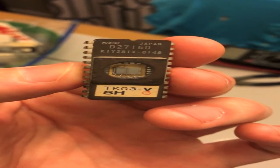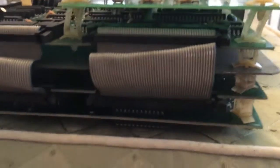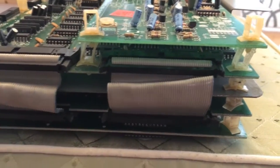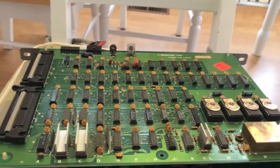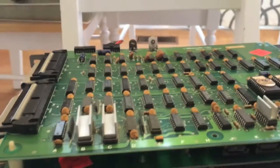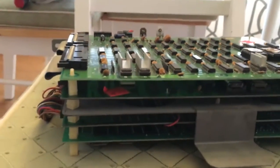I popped this chip and another one in — both in the 5H locations — and that was my problem. Not too hard of a fix but did take a bit of investigating. This is my Donkey Kong four-board set. Getting closer, you can see it's four boards: one, two, a metal plate, then three and four, with an audio-video board on each side. I spent several hours cleaning these boards — they were filthy — but a lot of Q-tips later they're looking much better and ready to go back in.